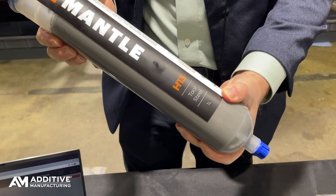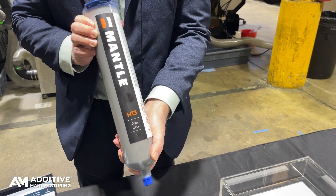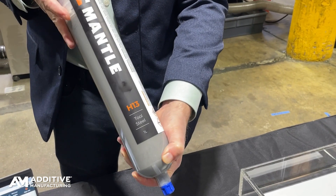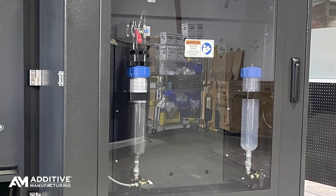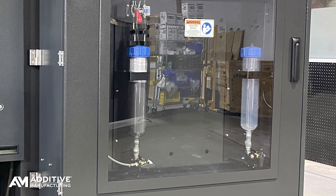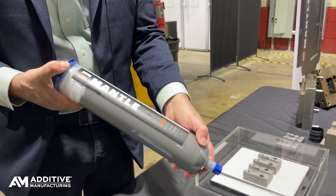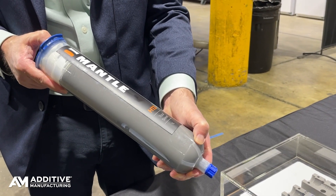There are maybe three mold tools in this tube, potentially. It is not H13 right now — it becomes H13. There are different ingredients of the final metal suspended in this paste. Separating the elements before sintering allows for tighter precision because the different ingredients sinter at different temperatures, so the entire sintering cycle can be controlled. The software's compensation for shrinkage during sintering is tuned not just to the material, but to every single batch. The user selects which batch is in the machine, and offset factors for shrinkage are incorporated into the toolpaths based on that particular batch.